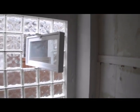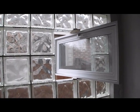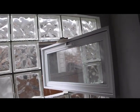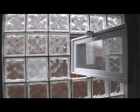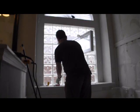Okay, here's another tool that you absolutely have to have to do this job. Crowbar. When I was taking out the first four pieces from the other side, found out that it's not going to stay together, so you know, don't shim it with the pieces of the glass. Just what I did right now is I'm just shimming it with the window that's going to go in there. And actually, these two pieces up here, as I was removing the ones below it, they didn't really have any danger of falling down. Didn't notice any real cracking in the cement, so pretty good to go. Gonna take out the next four pieces, rough it in there with some shims, and leave it alone for a while.